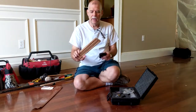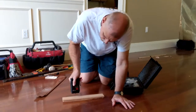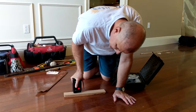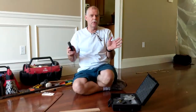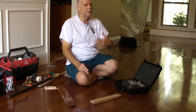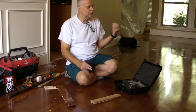This is a sample piece of oak. I've already set it for oak, so I push it into the wood and it tells me it's 7.0 percent moisture content. That's about perfect for a house. Sometimes it goes as high as 10 or 11 depending on how well the air conditioning does, but seven, eight, or nine is what we see a lot here in Louisiana — that's what a wood floor should read in a conditioned space.